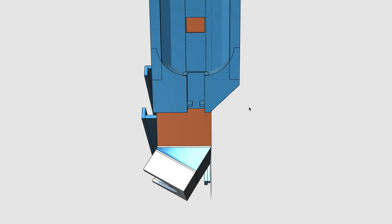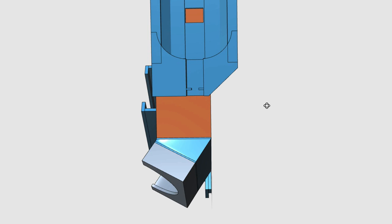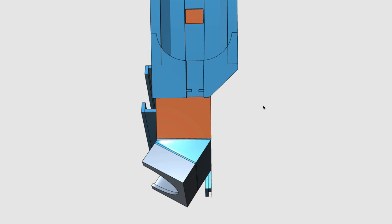I was fortunate enough to have a USB cord that had a gap in it where I could make these pins fit so that when I pulled the headphone in or pushed it out the USB cord didn't come with it. I print the headphone piece with the base down because you can print on a 45-degree overhang without worrying about support. So this printed just perfectly like this. Let's watch that print.